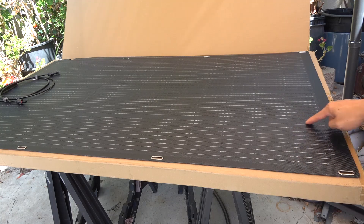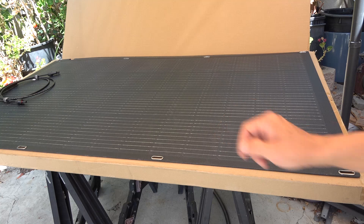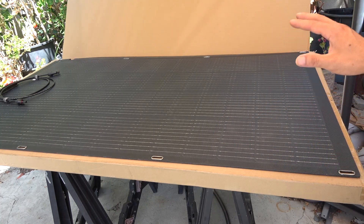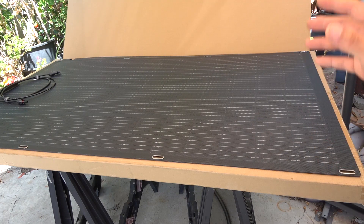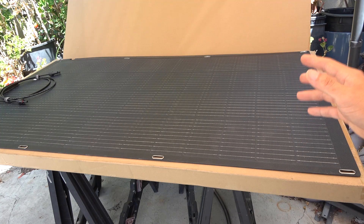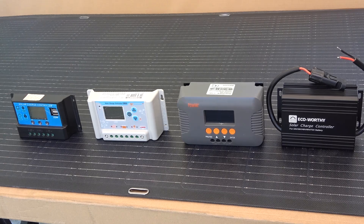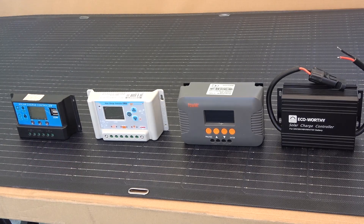This is one solar cell. There are 14 cells per row and 4 rows, for a total of 56 solar cells. Each cell puts out a little over half a volt, which is why we get 38-volt open circuit voltage on this panel. Because it puts out 38 volts open circuit, you cannot use a regular charge controller to charge a 12-volt lead-acid battery.